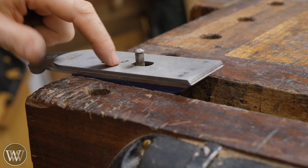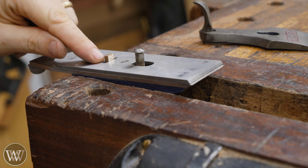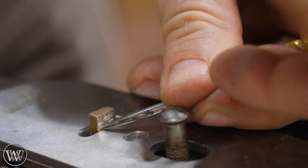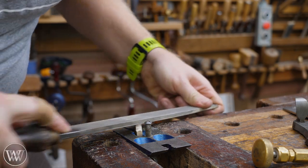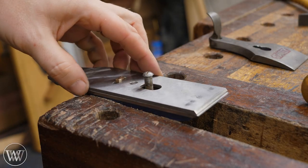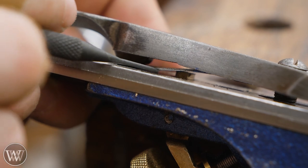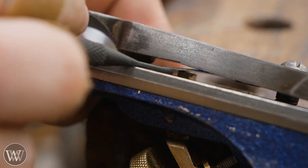The next problem: the yoke is sticking up a good bit above the top of the chip breaker — if I bring the lever cap in, it hits that and can't get all the way down. So we need to file this down until it's the same height. I'm going to mark it with an awl on both sides and then take this off and file it down to those marks. If you're working with a thin original iron it may be faster to cut it with a hacksaw, but for most of these it's quicker to file down. When you're getting close to your line, put the iron on and do a quick check — you want to make sure it doesn't run into the spring on the lever cap.